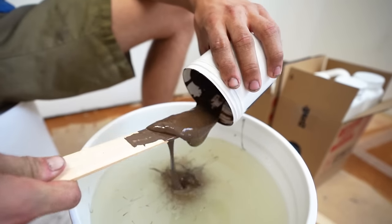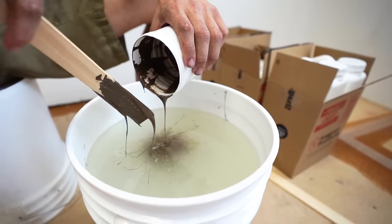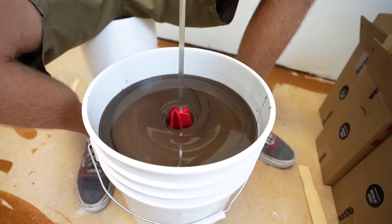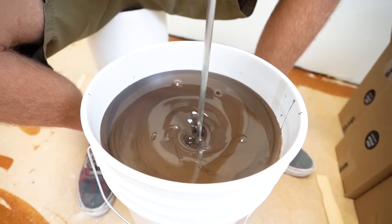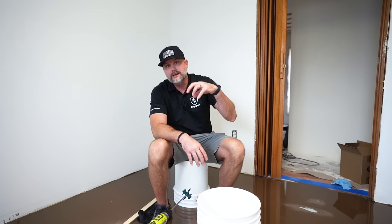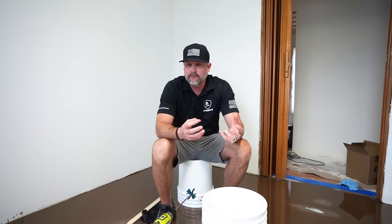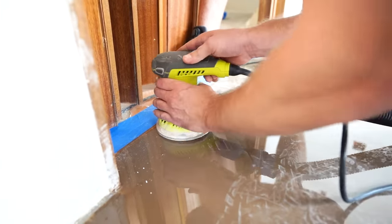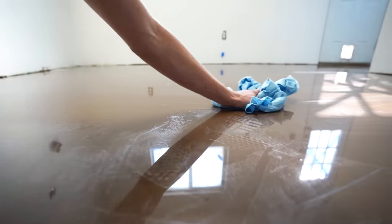We're doing our dark mocha flake system in here. And so we pigmented it a brown color that's in that flake system. Now, if we were doing maybe a metallic epoxy, right? And we were gonna do coffee color metallics, we would do the brown. If we were doing a white floor, we would have pigmented this flood coat white, and so we can get away without priming, and also we're gonna get a better bond from that resin soaking into that wood, right? It's very, very porous.